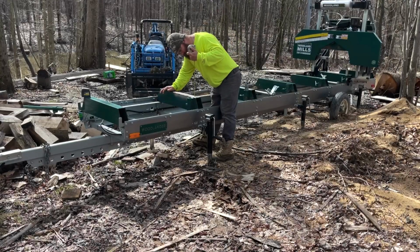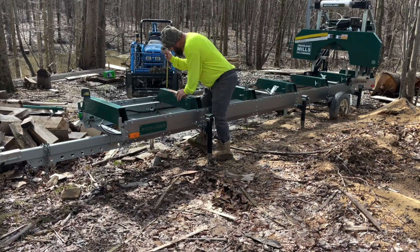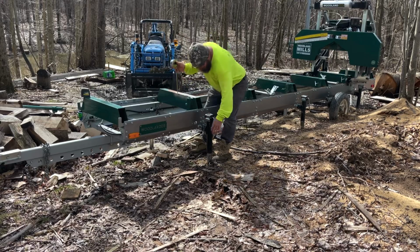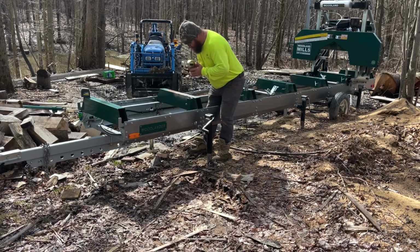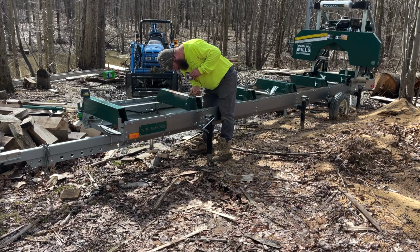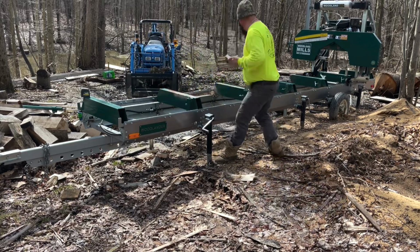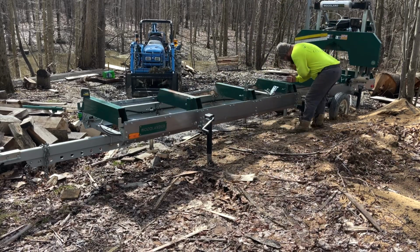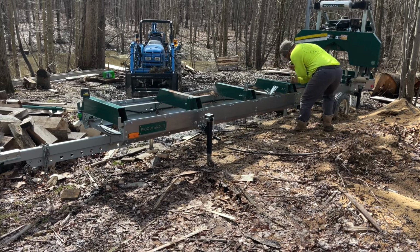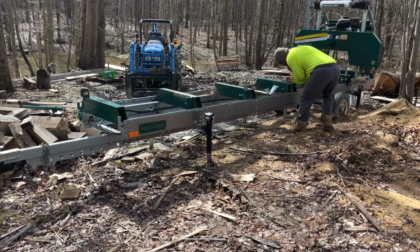Seeing all this wildlife up and moving reminds me of one thing. It's time to get the sawmill out and running for the year. The first step in the process, after uncovering it, of course, is getting the jacks leveled out and the sawmill nice and straight. So what I do for this is I get out the laser and adjust all the jacks so that my tape measure reads 1.25 inches, what the laser sits above the bunks. Winter's taken its course. With all the freezing and thawing, it's moved the jacks all around and the sawmill is settled.